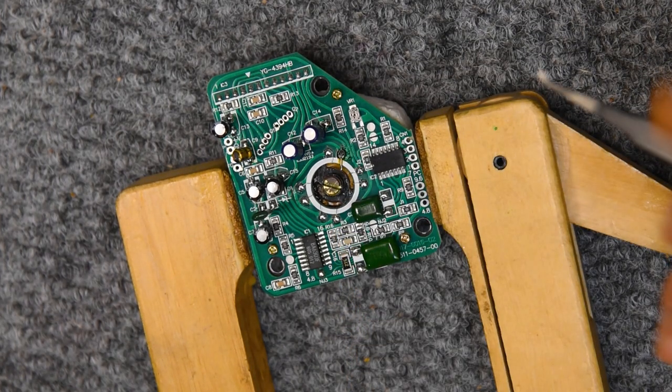I'm going to take a quick pause here and have you look at this damage on that screw, where an attempt was made to turn it and it was probably frozen, or maybe insufficient contact, but the screwdriver cammed out and scratched the brass, and also very likely made contact with those coil leads. And that may have been what damaged them and is causing the problems that I'm experiencing now.